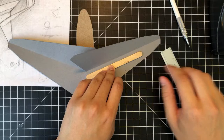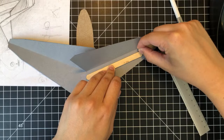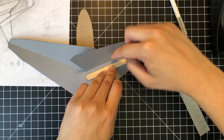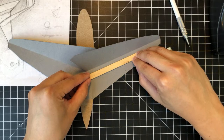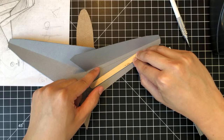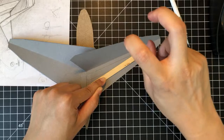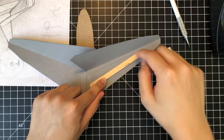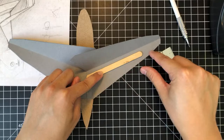You see, this is kind of like a sizing problem. So you want to make sure the margin here is about the same as the margin there. Then you want to make sure that it's parallel to the leading edge. That's just how I like to do it, because this creates a consistent thickness. If you vary the angle, you're gonna get a thinner wing section here versus at the tip, because this is closer to the front, so it'll make the front more blunt, so to speak. So if you make it parallel, that'll make sure that the curvature coming over the spar is gonna be constant, and then the back here can vary, which I think looks better.